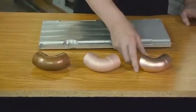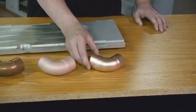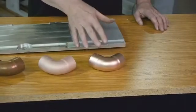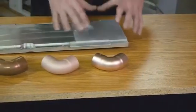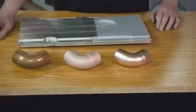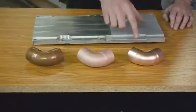And then even more brilliant is the glass bead. This is the fine glass bead on this part. This would look really good for anodizing if you used a color. Black is going to look pretty similar here. You'll see a little bit of a difference with the bright finish, but when you get into the color anodizing, this is where you want to be.